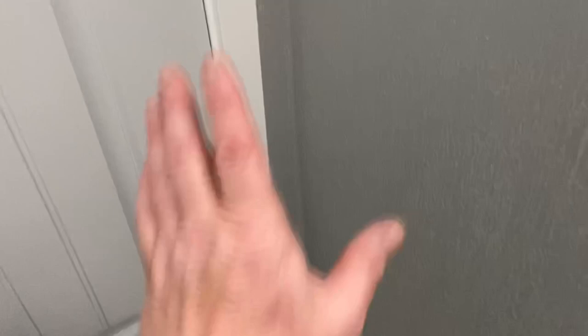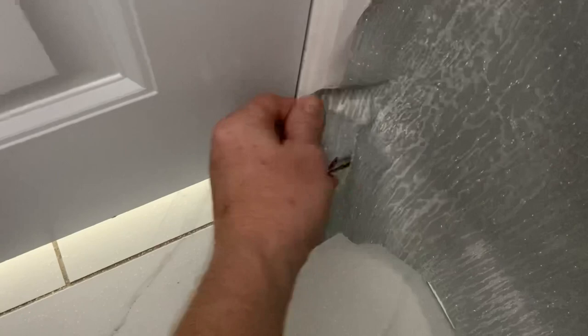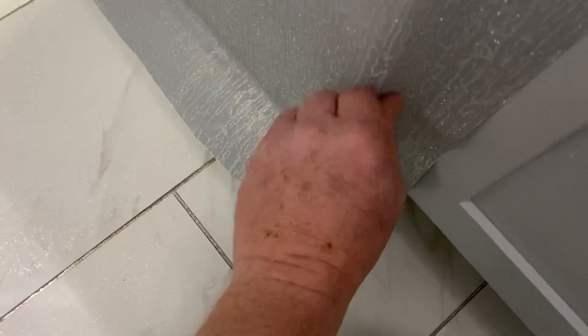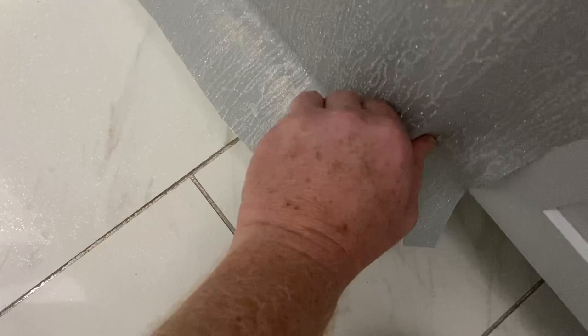With our paper straight, that's why we were able to make that cut. Cutting the stress points in sequence - all the A points first. We relieved that corner by cutting it and relieved the stress, so now I have a better read of where to cut the next stress point. You see that corner forming right here - it's cut right there. If you cut it in the wrong place, you're going to tear your wallpaper. When you cut the stress point correctly, you're relieving the wallpaper from being inclined to tear.